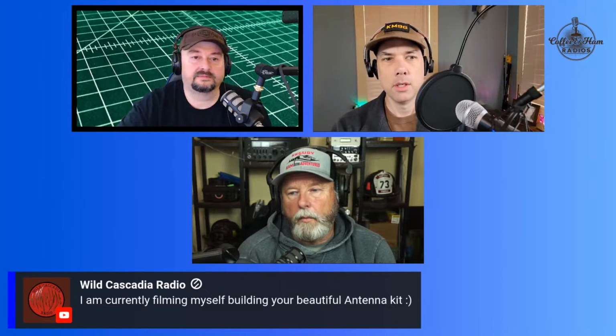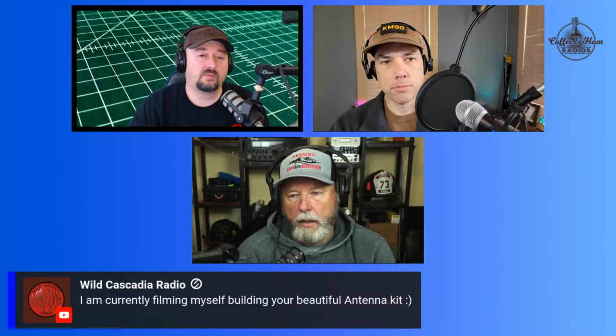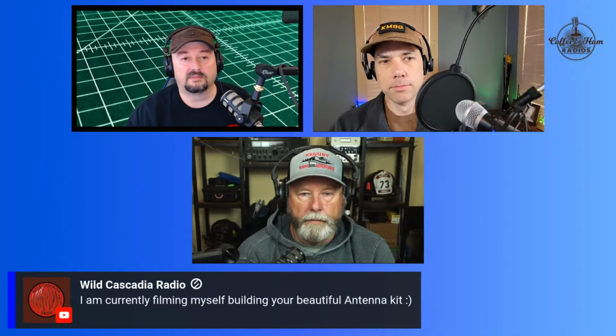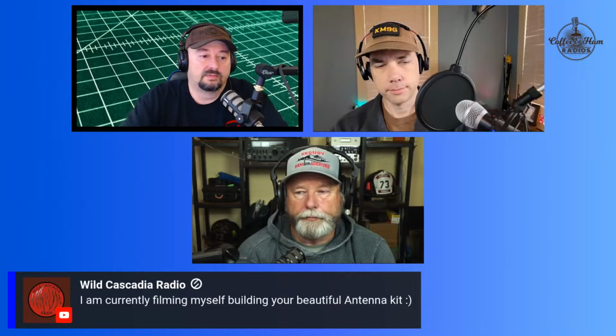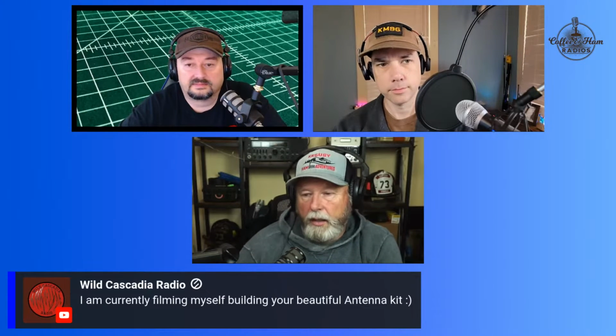Yes. So you can do it to make the antenna seem shorter. I wouldn't fold back 10 feet, you know what I mean? Maybe an inch or two, but you may have to adjust it. Eventually you want to cut some off, but do that in small increments too, because you may have to lengthen it again.